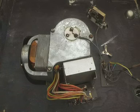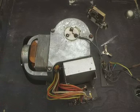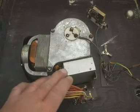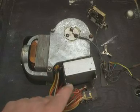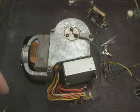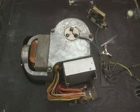And so I think the answer really is that this motor, which is why I'm interested in it, is an eddy current motor. And in this box here, I think are 1 or 2 paper, or perhaps even 3 or 4 paper capacitors, which shift the phase of the AC into this winding here, and so propelling the armature round. But let's have a look inside.